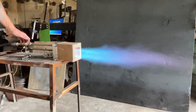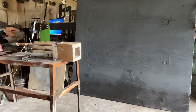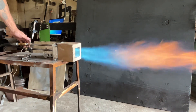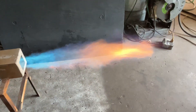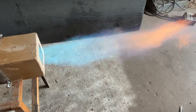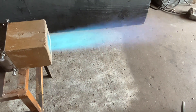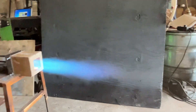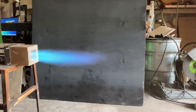That's full fuel right there — all the propane we can get out of a propane bottle, which is typically around 90 kilowatts. We're going to be testing this today on some very thick dirty bus oil, which is engine oil that came out of a school bus — a very heavy thick oil. We're also going to do a test on diesel fuel to get a full-spectrum analysis of this burner.